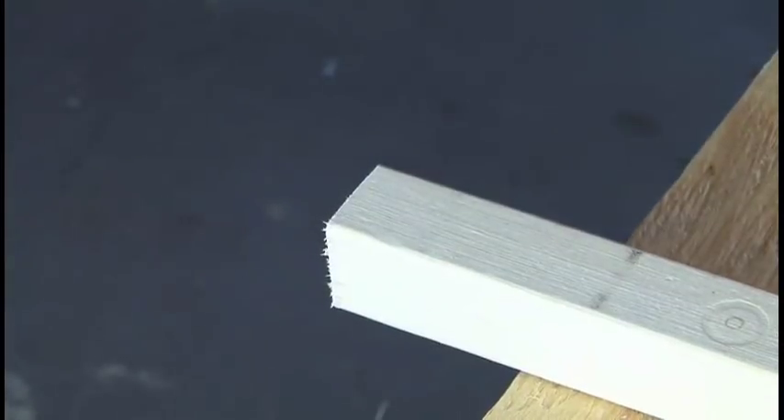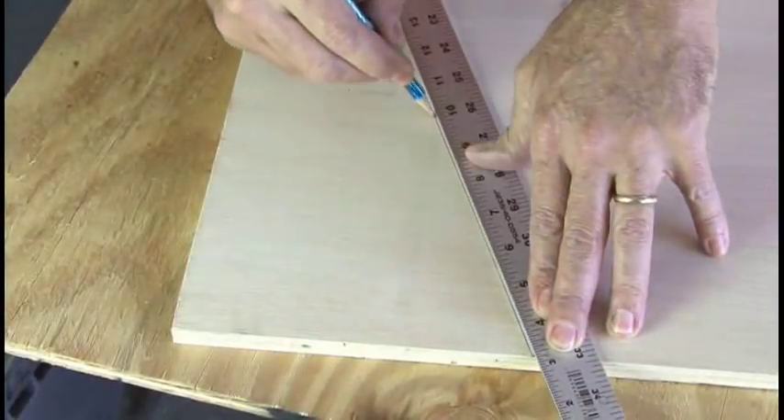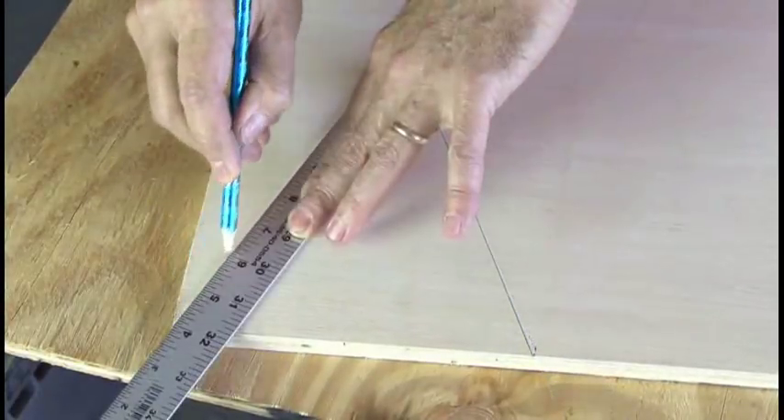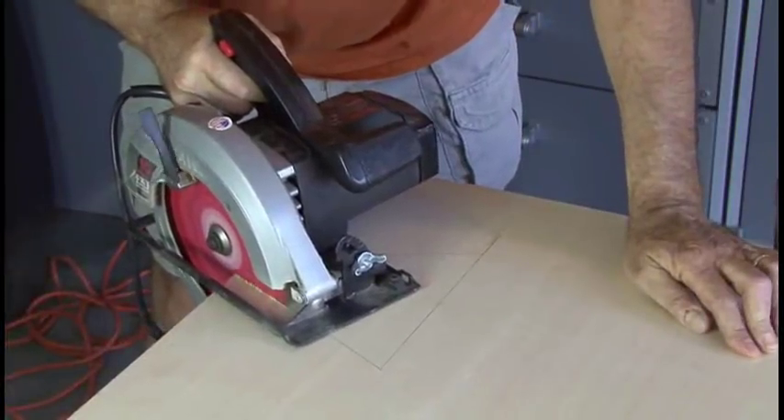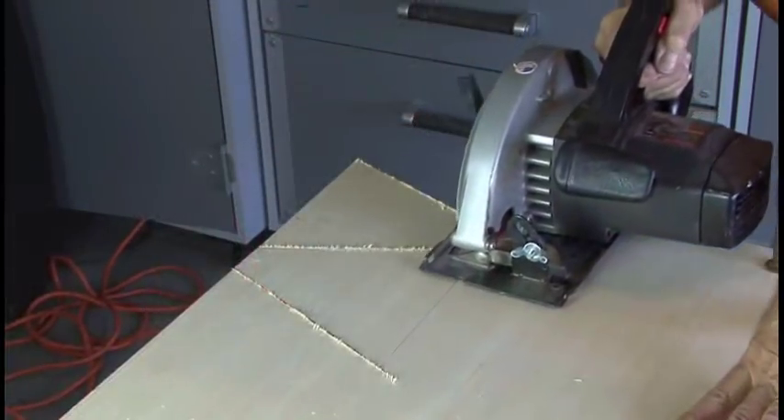We'll cut two sections of that. Then we need to cut out two supports which will actually hold the foot plates — these are going to be two trapezoid-shaped pieces cut out of plywood. You can easily save material by cutting out both pieces at the same time, and you'll probably want to sand all of the edges for everything you cut.